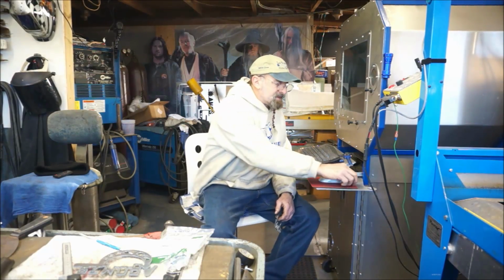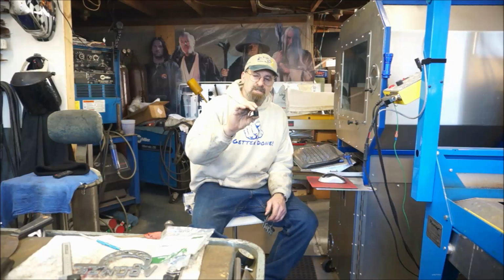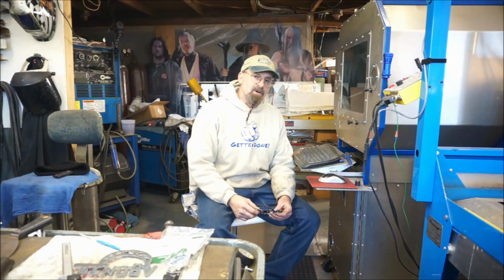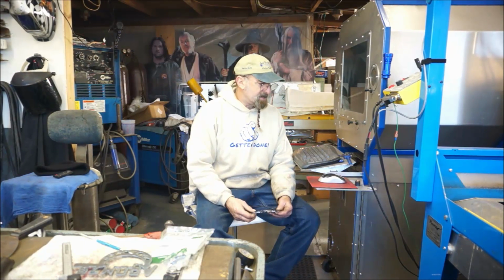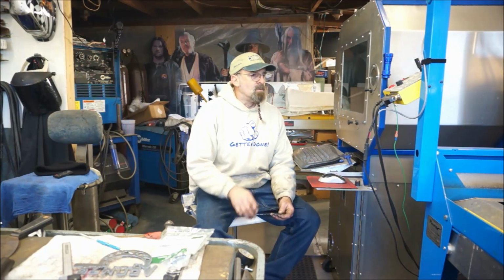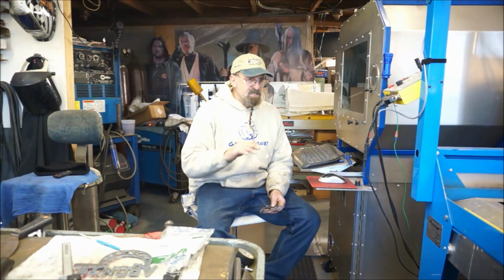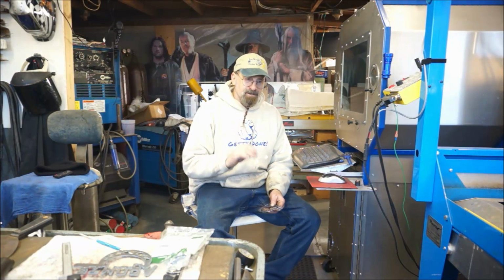We were waiting for starting cartridges to come in. I was in need of getting them, and Adam's project kind of made me expedite them a little bit. So I ordered them last week, and I just got them in here today. And so we got them in the machine because I wanted that crisp start. I was starting to lose that, and it gets finicky, especially on hot roll. Hot roll is pretty touchy because that mill scale on the outside sometimes just really hinders that initiated pierce.